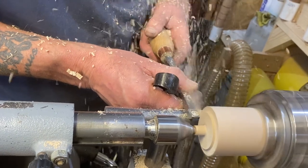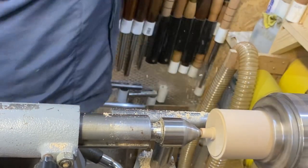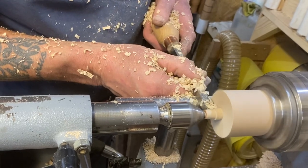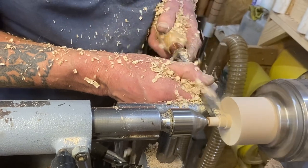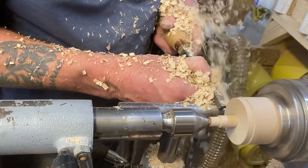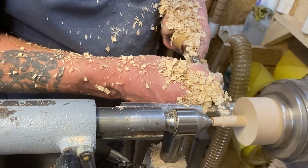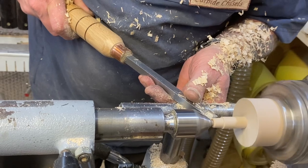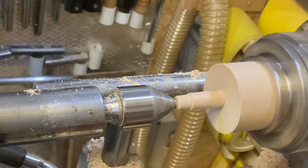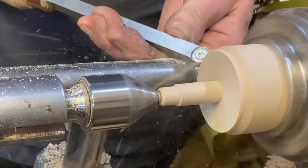And then bring this bit down to about 12 mil. Now you don't have to measure it, just do it by eye, you just want it a couple of mil bigger. And you want that to go back quite a way. Get it all nice and smooth. Put a tiny little chamfer just on that end there, makes it easier to get in. Alright? Then the second one, 12 mil round, just to chamfer this round.